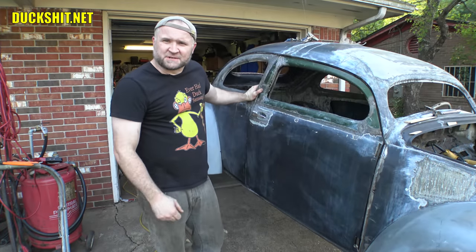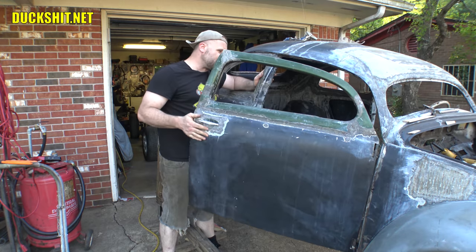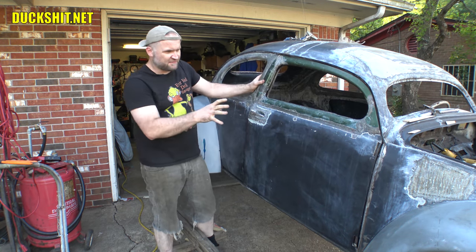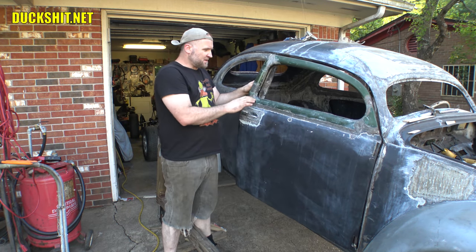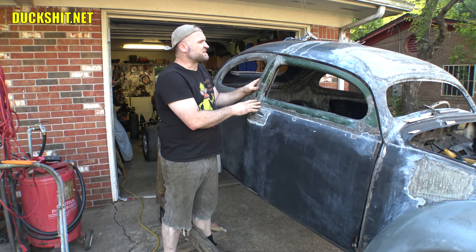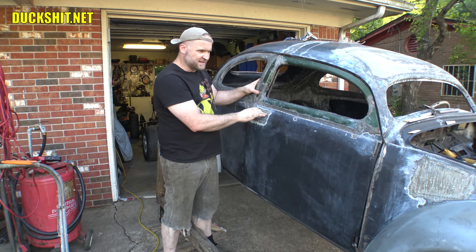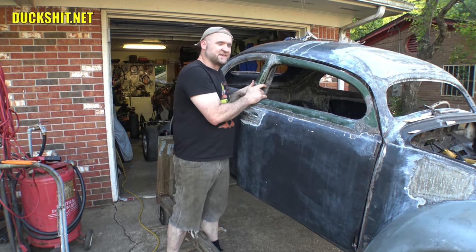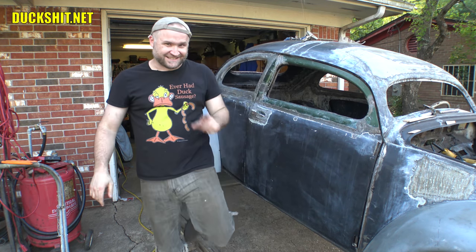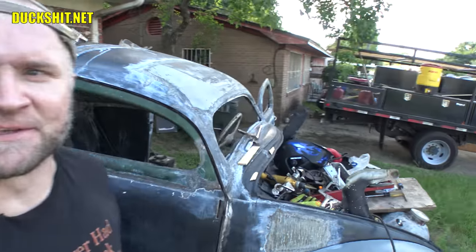So anyways, I got to adjusting some things over here and playing with some stuff, and the door opens pretty well. I'm pretty well satisfied with it. I got a few more welds on it, but I'm not done with the welds and the hinges yet. The door does have a little tiny bit of a sag. I can see it. It's less than 1/4 inch, but it does have a sag to it. But I figured out what it is. It's not my hinges. This is something I'm glad I noticed, because I'm gonna have to make some adjustments to it before I finalize everything.